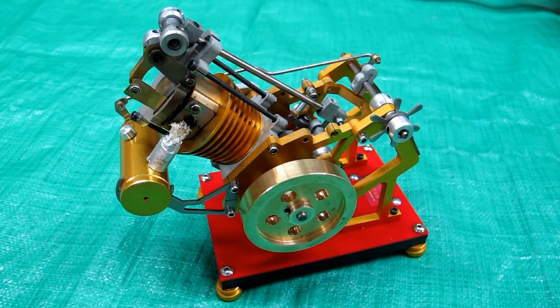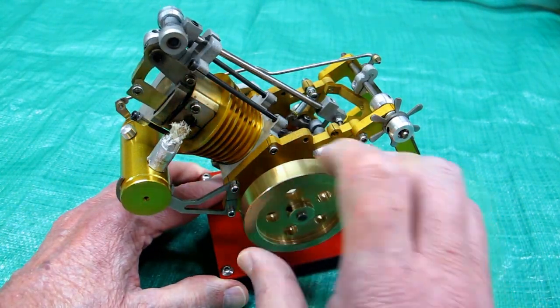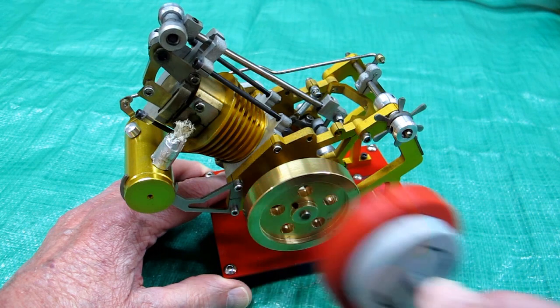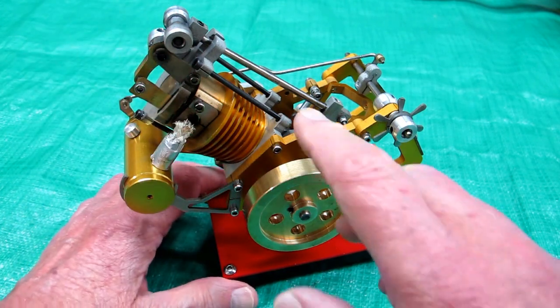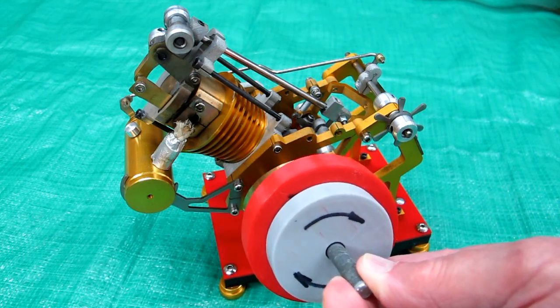Taking a page from the bronze lazy engine starting manual, I've made a smaller version of the starter, like I made for the hit-and-miss engine. When you're trying to start this and you're just flipping it, this thing is sucking the fire in once or twice, and all the flame going up here is just being wasted. So if we can keep turning this over slowly and keep that fire going in and out of here until we heat this cylinder up — this will not run until the cylinder comes up to temperature. You can preheat it with a hot air gun like I've shown previously, but this should be a quicker and easier way to get it to run. The STL file for this will be on Thingiverse under my name, listed as a vacuum or flame-licker engine starter.